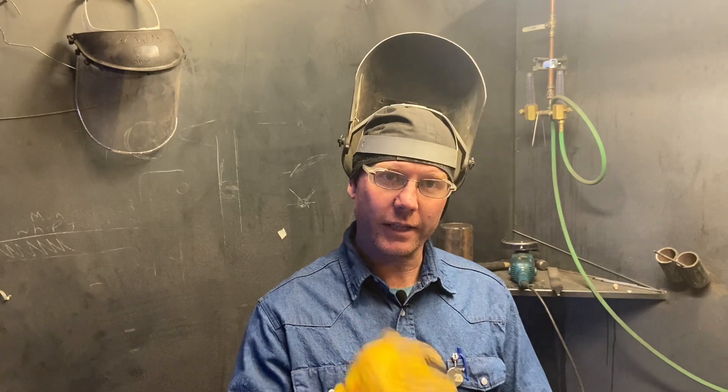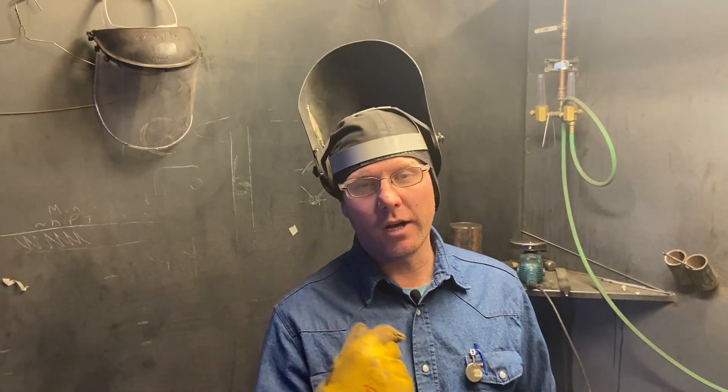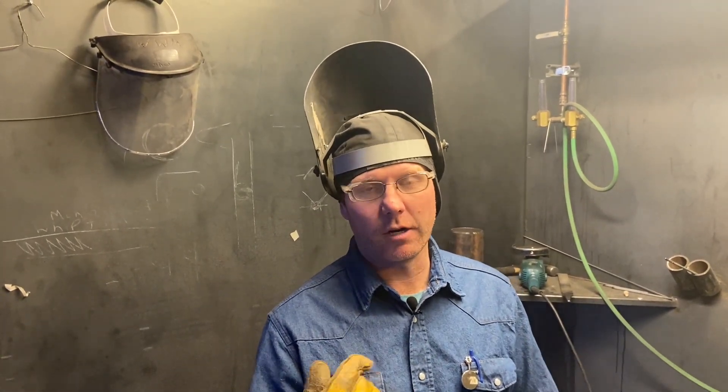We're going to start out prepping our piece of pipe. You get a four inch piece of pipe, you get a four and a half inch grinding disc — you can face it off just like it's on a machine. Then we're going to set that in a 2G, get our gap, put a couple tacks in it, and we're going to run root with 6010. We'll grind that off, run a hot pass with 7018, run our fill with 7018, and we'll cap it with 7018.